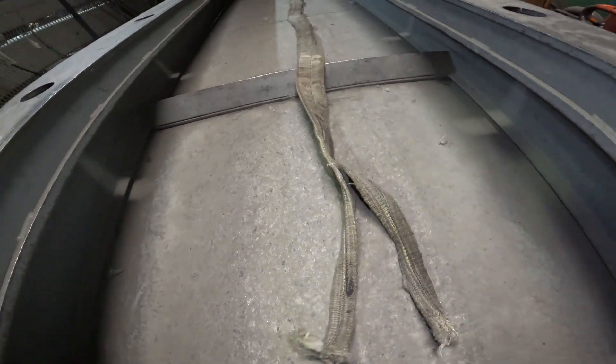When you're doing break tests, you have minimum size pins that you break on. Naturally, the larger the pin is, the more strength you get in the sling — the smaller the pin, it kind of weakens it. This one was tested around a two-inch, I think a two-and-a-quarter-inch pin — I think that's what's in the two-inch shackles.